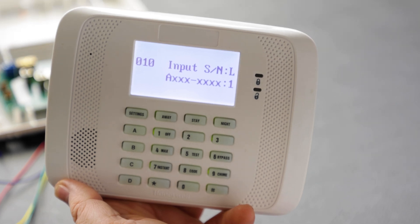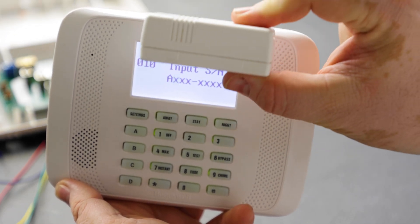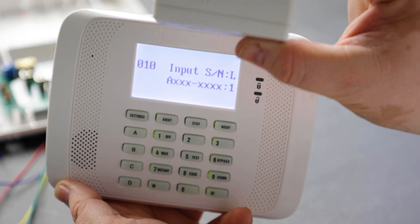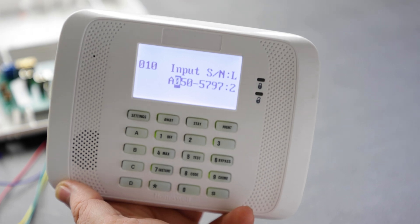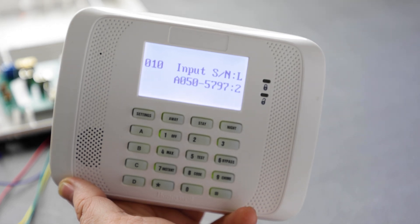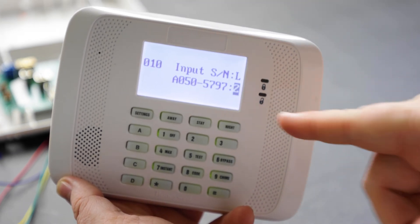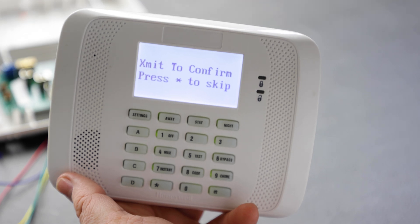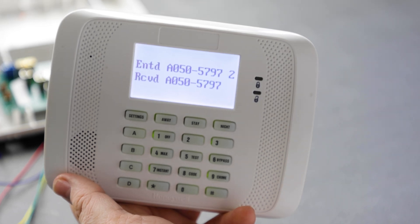This is the screen where you learn in the serial number. We have a 5816 today — there are two markings on the side showing the correct magnet orientation. When triggered, it should be learned under loop two. We trigger it once to display the serial number, trigger it again, and after the second trigger it flashes under loop number two. Hit star, and set-to-confirm will verify the correct serial number — trigger it again and we should see the same serial number twice under loop two.